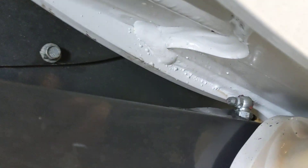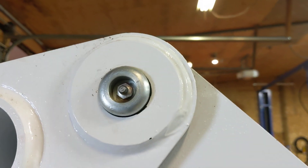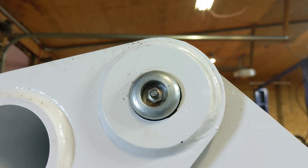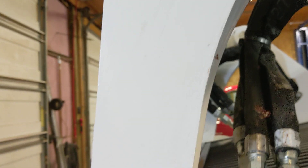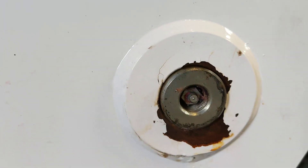There's another greaser tucked up under there on the stabilization linkage, and the other end of the linkage. Up here on this pivot on the upper arm — as you can see, it's down inside there. And lastly, for the lift cylinder, it is right there.